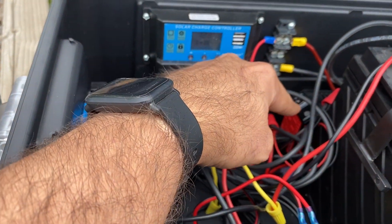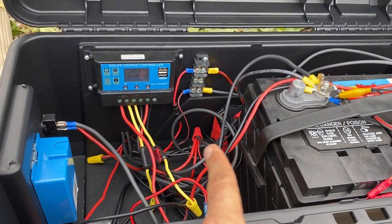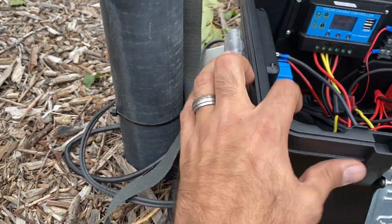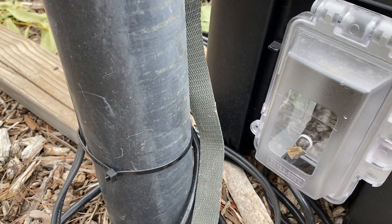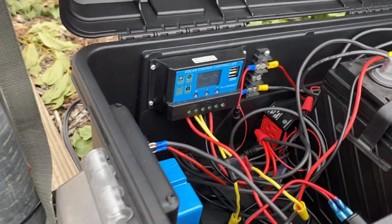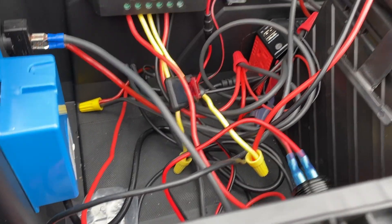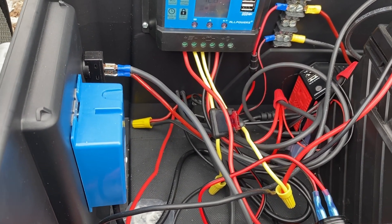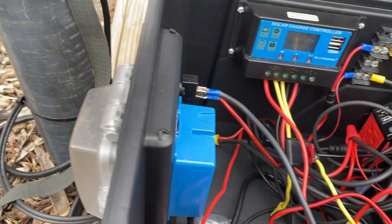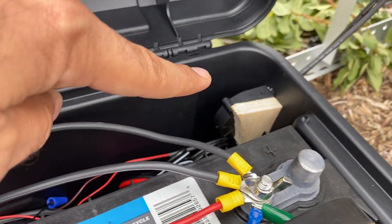The way I've got this set up: I have the charge controller going to a pure sine wave inverter that converts from DC to AC, which is then running to an AC outlet where I have the overhead lights plugged in inside here. I've also tied in those fence lights — that goes straight DC. You want to keep it in DC as often as you can so you don't lose a bunch of power to the conversion process. I also ran a switch to the floodlight — so that's powering the 12-volt floodlight.